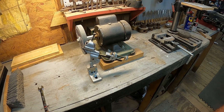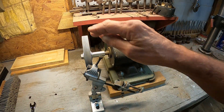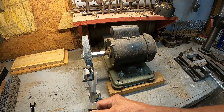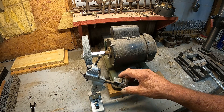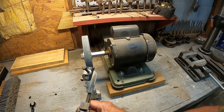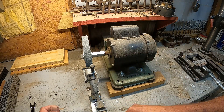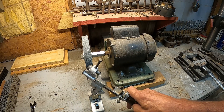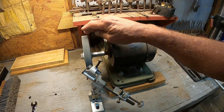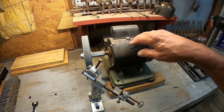On to the next project. A while back I made a homemade grinding jig — well, not jig — I got this US General drill sharpening guide, which works pretty good for what I need. I don't do any precision type stuff, so it's fine. But several guys, a couple of machinists, and people that know how to do this told me my wheel is running backwards — it's running toward me and it should be running away from me.